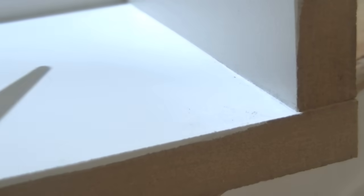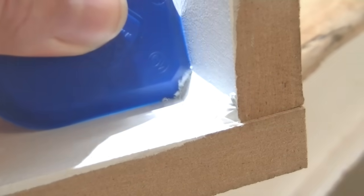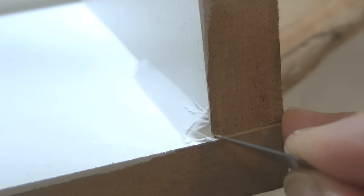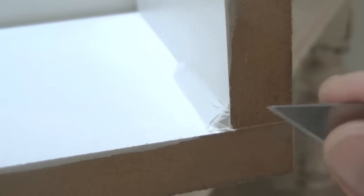Now my last point in this section of things not to do is not quite so important, but the established wisdom on this is that you shouldn't really cover all three corners of the joint with silicone. Now the reason for this is that if your joints have got a bit of movement in them, and possibly you're using a high modulus, i.e. a stiff silicone, then by adhering to all three sides of the joint, if there's any movement, the silicone can start tearing pretty easily.